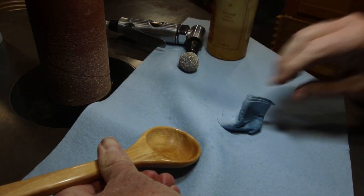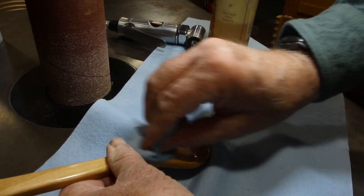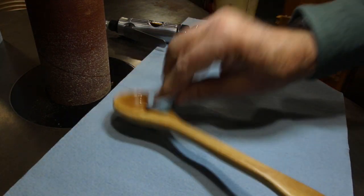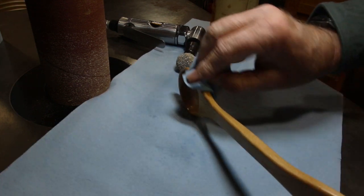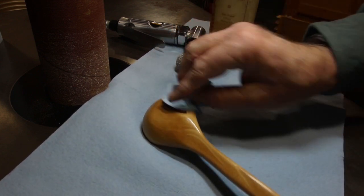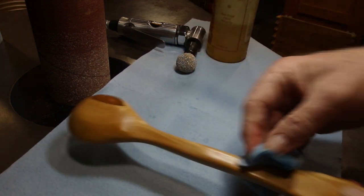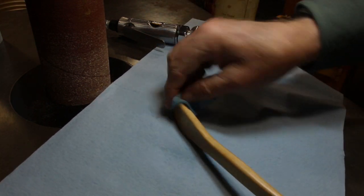Now, you don't sell these spoons for very much, so you got to get your time down and come up with a design that you can crank it out. That was the purpose of this one, having the wider, thicker handles. It took much less time to sand. It was easier to cut on the bandsaw. You really got to watch your cuts. Every time you make a deeper cut or a variant in line, it becomes harder to sand out. And again, much more time consuming.